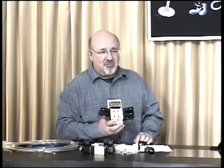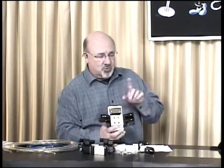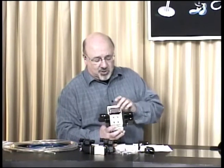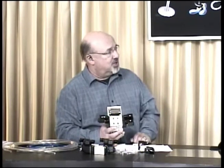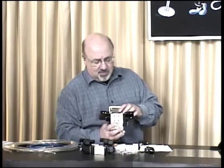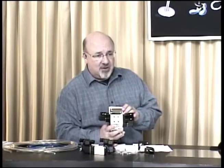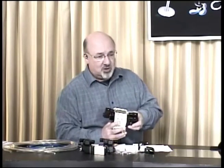I should mention, back on the other valve, hopefully I did mention that there are manifolds available. We have them in the 52 series or the 53 series. They're blanking plates. We'll show a slide of that. What's nice about this, I can buy these manifolds in either 2-position, 4-position, 6-position, or 8-position. So it eliminates a bunch of piping between valves to get my pressure to the different valves and then out to the different cylinders I'm going to use.